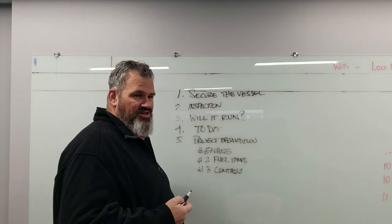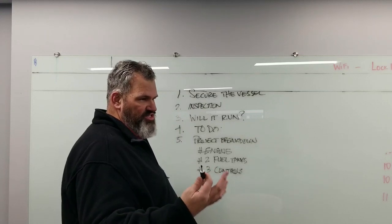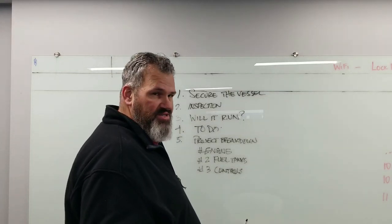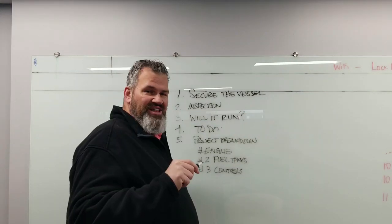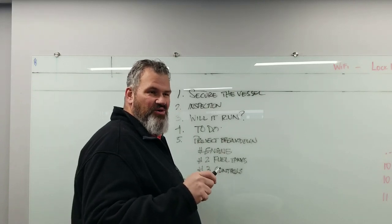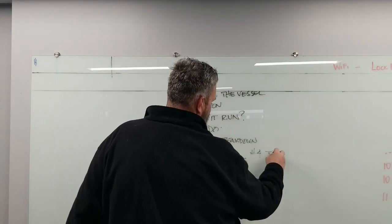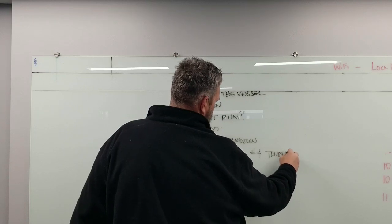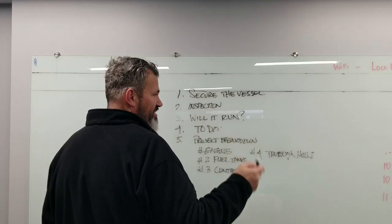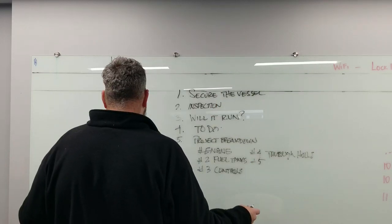A lot of older tanks were sealed with foam which is supposed to be impervious to water, but over time it gets waterlogged, and that water sits on the tanks. Whether those tanks are steel, poly, or aluminum, they ultimately need to be replaced on older boats. Number three — controls functionality. On this last vessel I was looking at, the flybridge throttle and shifter linkages down to the engine: one was working fine, one was seized up.